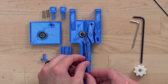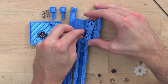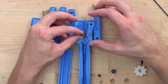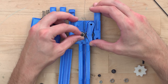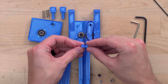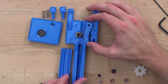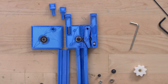A bearing on the opposite side will push the solder into the drive gear, which can now bite into the filament and get a nice grip. That amount of grip will be determined by how much pressure the bearing pushes into it, which is adjustable because the bearing can swing back and forth. This also allows you to use solder as small as 0.5mm or up to 2.5mm. Even larger solder can be used, but you will have to adjust the hole size of the solder guide component.